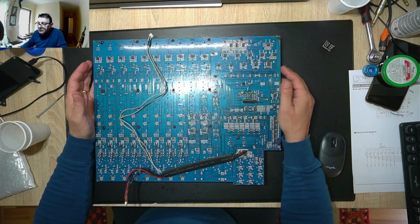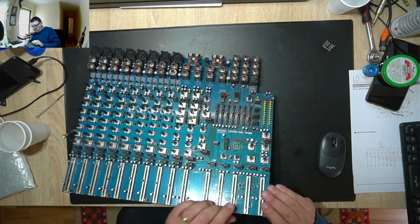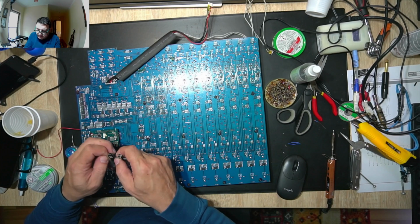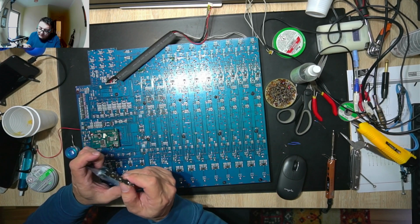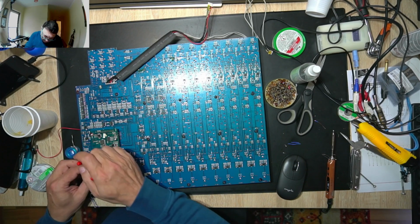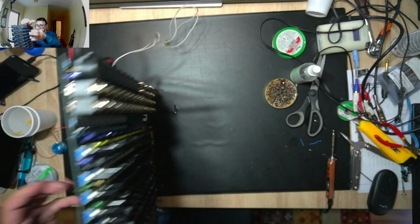That sucks. Okay, people, next is to see what's happening with the main fader, which looks to me a little worn. I think I'm going to replace this. I'm trying to adapt one of these guys. It's designed for Soundcraft. Now I have to make a kind of combination pin by pin to fit on the board. That shouldn't be a problem. We just have a few short wires for the signal path, in fact.